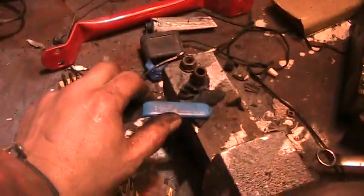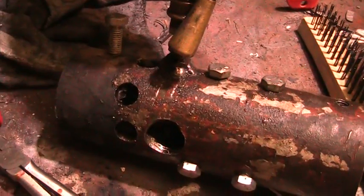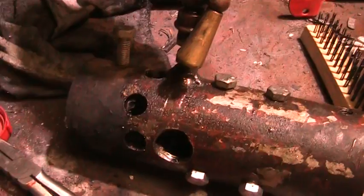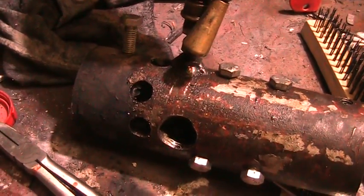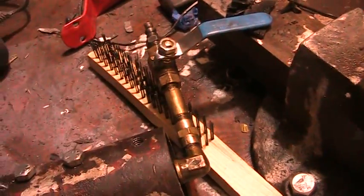On and off for the air, and you light it through one of these holes. I drill my burner tube full of holes — it seems to need a lot of air right where the oil drops, close to it. The combustion air seems to work best right there. Your atomization air goes through the two or three nozzles — fair amount of air.